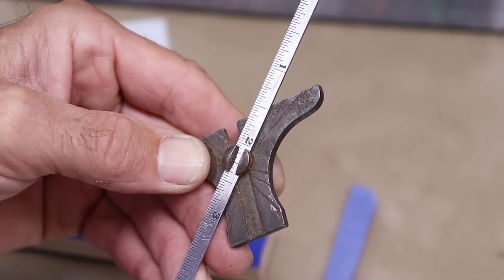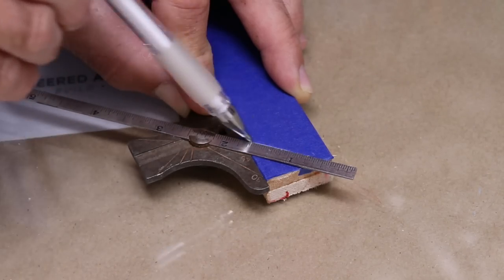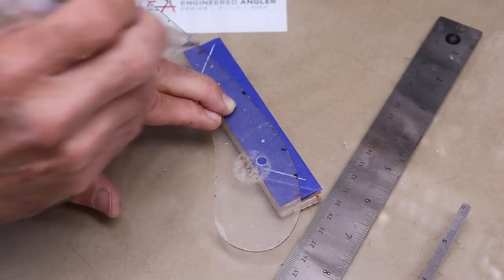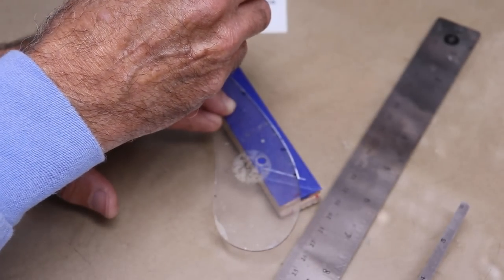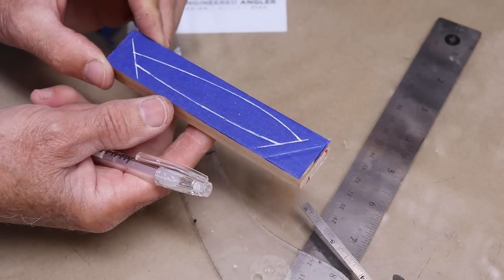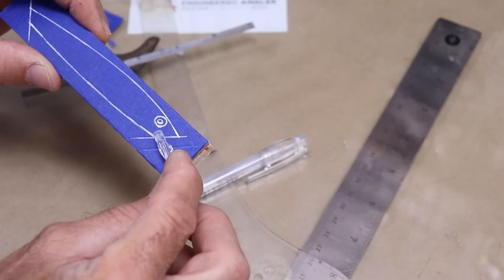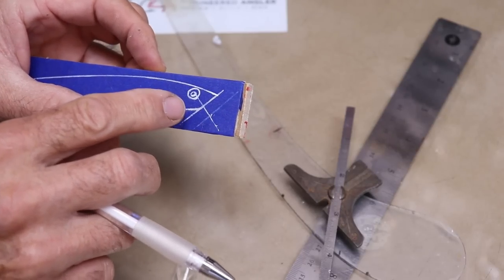I'm going to set this little square to 45 degrees and draw a 45-degree line for that front face, and do the same for the tail. I'm going to use this draftsman's curve to lay in the shape of the lure — it's a basic shape so I could have hand-sketched it, but this will be a little neater. I want the belly to be just a little bit rounded downward. I'm also going to draw a working line where the diving bib will be inserted, perpendicular to that angle, so I can use that when I drill later.